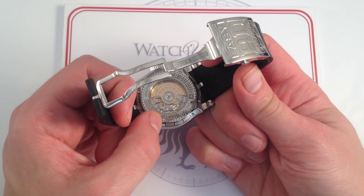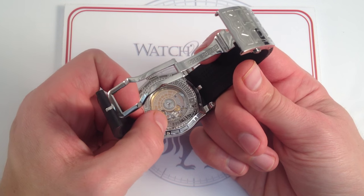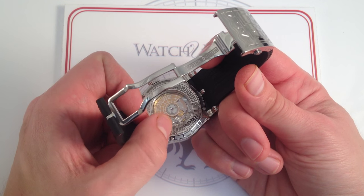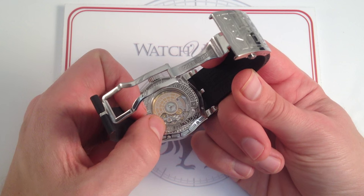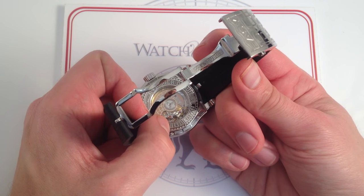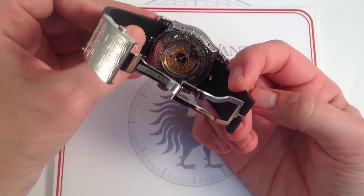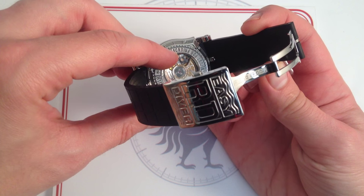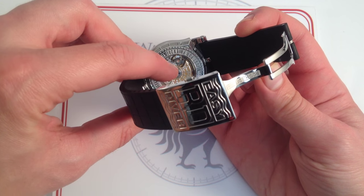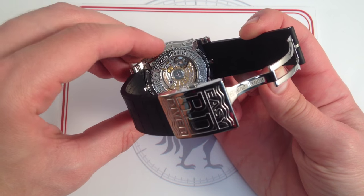All of the classical elements are here. The anglage on the Roger Dubuis in-house calibers is what I like to call fat anglage, which means that the radius of each chamfer is exceptionally broad, round, and mirror-finished. The gleam — that mirror-like radiance that you need to see with a loupe on other watches featuring Geneva Seal standard finish — can be seen with the naked eye on a Roger Dubuis. Likewise, black polish on the screw heads, as well as the stud holder on the balance, the swan's neck regulator and its retention spring, and the cover for the bearing on the winding rotor — all of this is in evidence and of exceptional quality.